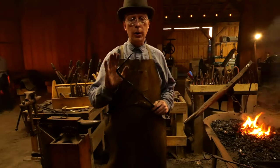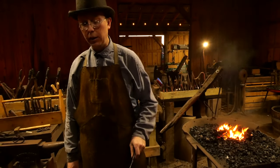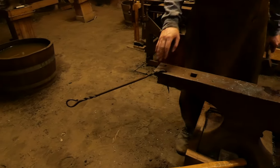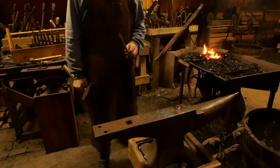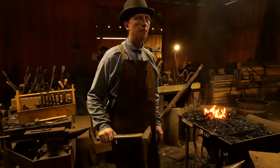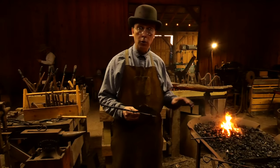If you've got a coal forge, this is a great first project to make. You can make it without any tongs - just your hammer and your anvil - and it is an essential tool while you're working in the fire. It can also be a pretty effective way to deaden the noise on your anvil. You'll notice coal rakes hanging out of the pritchell hole on a lot of these anvils. If I pull it out and give the anvil a hammer blow, you can hear it ringing - real unpleasant, not great for your ears. Drop the coal rake in there and it ends that vibration much faster. We've got our coal rake finished up - very happy with how this looks. Essential tool for the fire, absolutely something you want to make if you're going to be working with coal or charcoal forges.